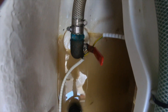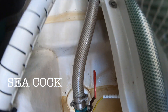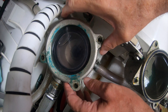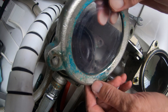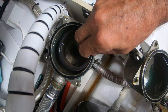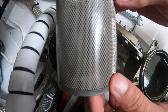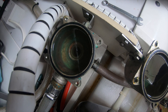First we need to turn off the seacock to the strainer. Now I'm taking off the strainer cap — be careful not to dislodge the perspex cover on top and drop it in the bilge. There's the cap. Taking out the strainer and having a look — well, the strainer looks pretty clean actually, so what I'm going to do is flush it through with fresh water.